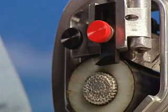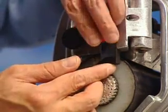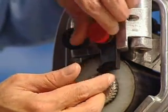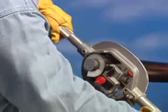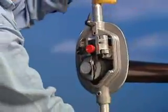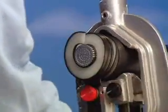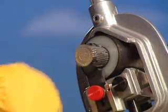To remove the insulation, the WS57A operates in the same manner as was used to remove the outer jacket. Set up the WS57A as before, adjusting the blade to approximately 1/32 of an inch above the conductor. Rotate the tool counterclockwise, applying a slight forward pressure to engage the blade into the insulation. Continue stripping by applying this forward pressure until the proper length of insulation is removed.